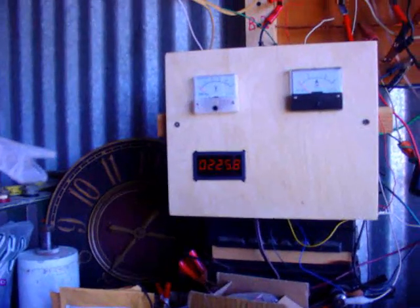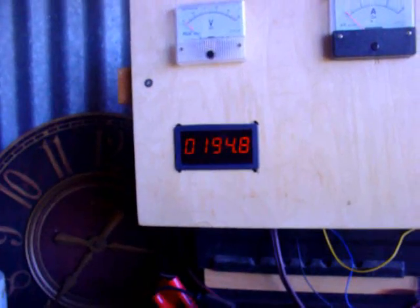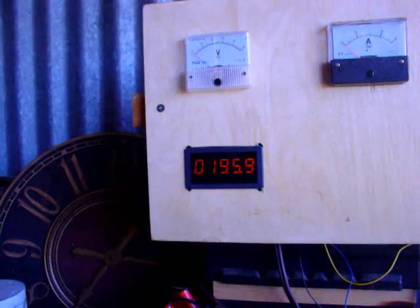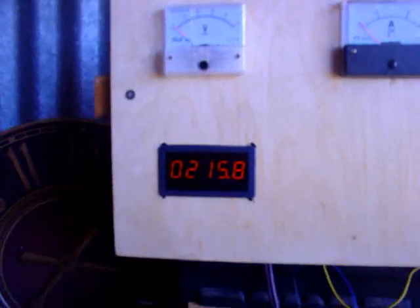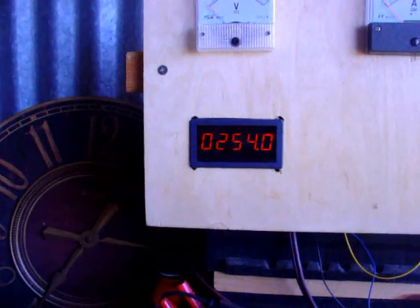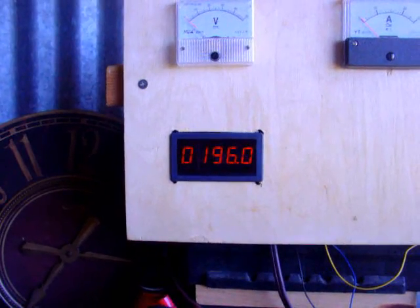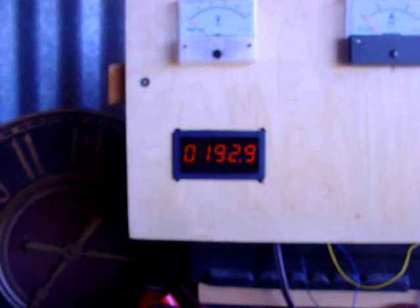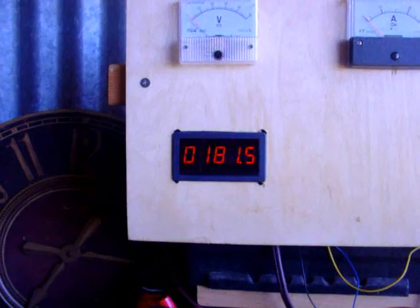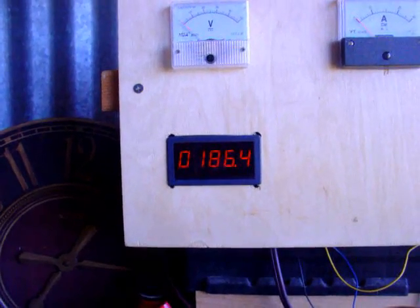We got about 7 to 9 miles an hour and we're looking at 235, 212, 194 RPM. It kicked off pretty good, started up pretty quick — looking at 188 RPMs. That's going to really come in handy when I figure everything out. I'll know this prop's RPMs at various wind speeds, and I'll know how many RPMs I need to reach charging voltage. That way the blade doesn't stall out. If the alternator reaches charging voltage too early the blades stall; if the blade spins too slow it takes about 12 to 14 mph before it starts charging. Knowing this will let me build revision two, bench test it, then put the prop on and know exactly what it'll do.